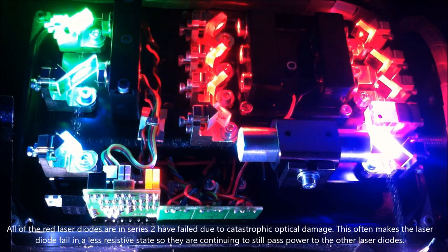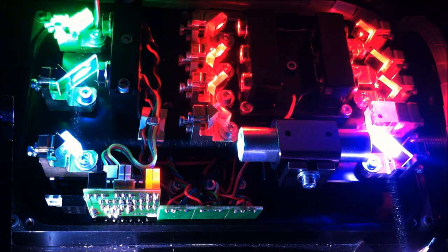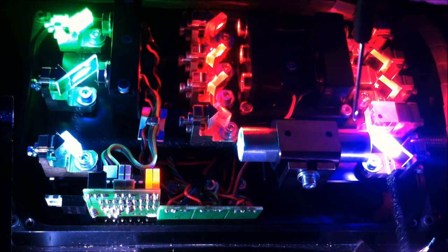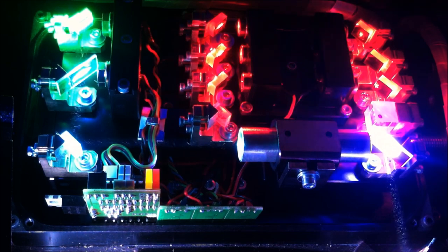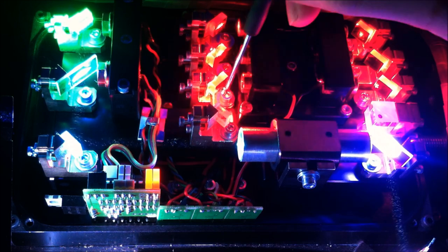Alright. Well, we also got a green laser here, the green laser beam coming off, being reflected by that little mirror right here, and it looks like we have a, yep, blue laser right here. So green laser comes in here, in this top area, reflects off this mirror, comes down, hits this dichroic filter, and the dichroic filter mixes the green and the blue, and the mixed green and blue lasers bounce off this mirror and then go into this optic right here, which is probably a lens assembly for the correcting optics and a spatial mode modulator. It's basically to make sure the beam is looking really good. And yeah, a knife edge arrangement with 6 red laser diodes. In this case, 4 it looks like.